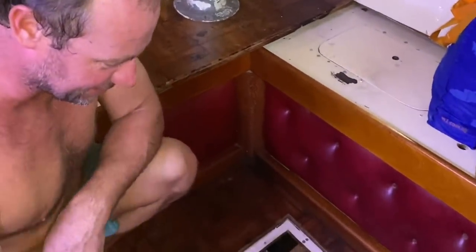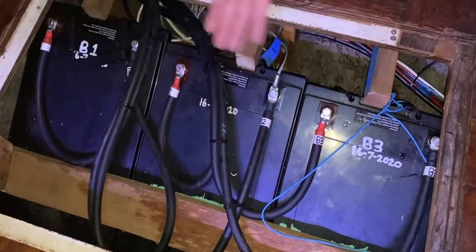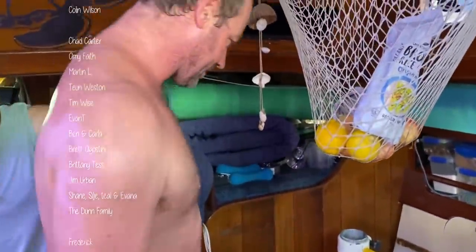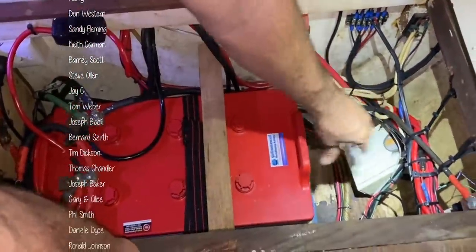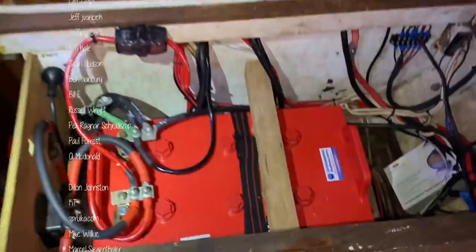That lot's secure — I've put a brace in so the batteries can't come up, and even though they're leaning downwards I've added blocks to stop any movement when we're heeling over. They're secured and done. I've screwed another block down and put another block in the back — I didn't trust the strap in rough conditions, so it's all blocked in, screwed down, bolted down. Job done. Good job captain — let's sail to Africa! If you haven't already, we have a new channel, Life on the Sea — go subscribe. See you next time guys, bye bye.